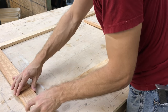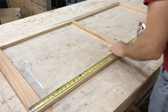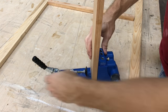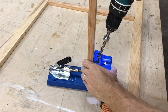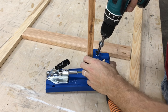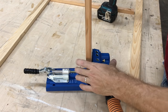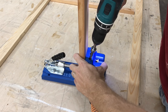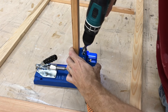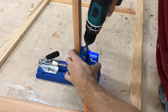I like to lay them out on the table first. The bottom rail is the widest, meeting rail is 1 inch, and the top rail is 1 and 11/16 inches. I'm going to transfer the measurements from the prime window onto the storm window — I measured it previously, so now I know how everything fits. For drilling pocket holes I use the Kreg K4 pocket hole jig. It's really easy — it's just fantastic for this. It's got a vacuum attachment, so as I'm drilling there are no sawdust or wood chips coming out, which is really helpful in my extremely messy shop. The bottom rail is wide enough that I was able to use the two wider hole settings for more support, and on the top rail I drilled the two holes closest together. I'm doing two pocket holes on each side for extra support. The meeting rail I'm just doing one pocket hole, and that's more than sufficient.